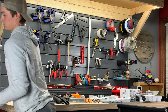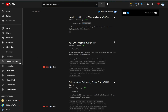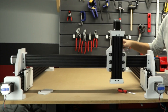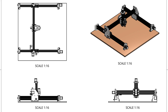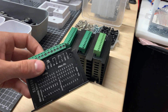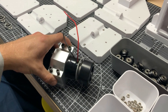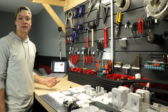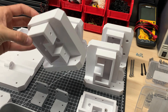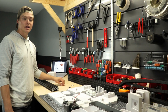For the most part, all the prep work like cutting materials and sorting out the minor details have been taken care of to make the assembly more fluid. The mainframe is built using C-beam aluminum profiles, with the design inspired by Lorenzo Battistino, a fellow YouTuber, though completely redesigned from scratch using the OnShape CAD software. For the driving force, the CNC uses four NEMA 23 stepper motors driven by four TB6600 drivers and an Arduino Uno running Grbl. The spindle is a 500-watt unit with variable speed control. To begin, we start with the left Y axis, using one 1000mm C-beam profile and two 3D printed end cap base mounts, fastened together with M4 socket head bolts threaded into T-nuts that slide and lock into the profiles.